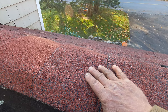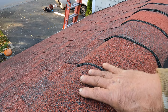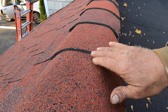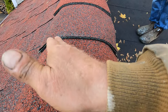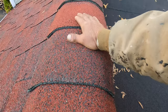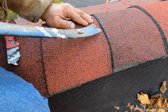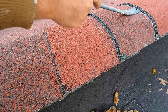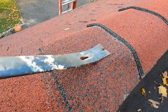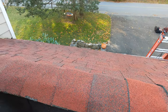Here's what I found — this is a common place for water to leak in an attic or a pitched shingle roof: the ridge cap. This ridge cap looks beautiful, but I'm going to show you how water can leak in here. The ridge cap has dipped right here, and water will follow right underneath there. See — water flows right there, and there's a hollowness. It goes right below the flashing.